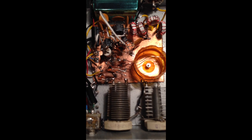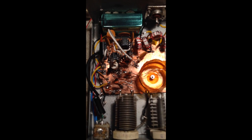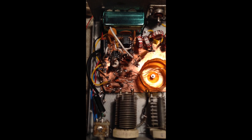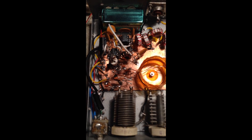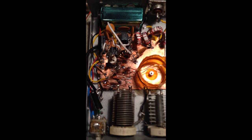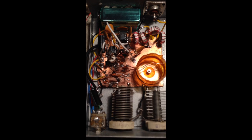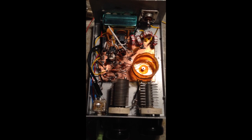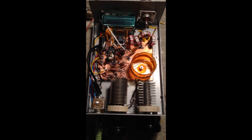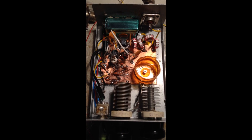Basically just picking combinations of NPO capacitors and how I put them together to make it a little more stable. I made some headway with that. The initial circuit was very jumpy, and if you touched the front panel at all it would just tune way off frequency — it was kind of a disaster. So I got that stabilized a little bit better.